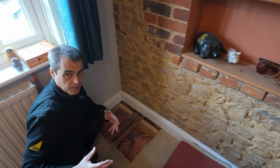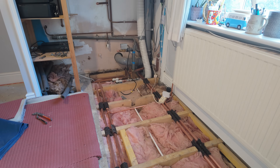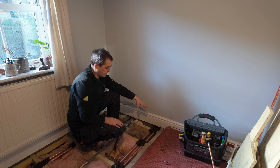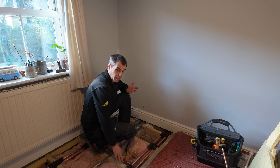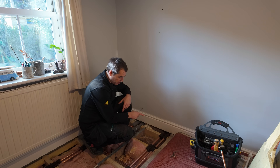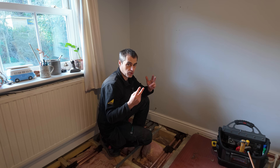Monday we're back on site and it's the coldest week so far — temperatures are dropping below zero — not the best time to remove an existing heating system, but we have no choice. So far we've run pipework: hot, cold, secondary return, flow and return going back to the house, insulated below the ceiling. The flow and return from the plant room in the garage goes 35mm copper all the way here, then reduces to 28mm — 35mm through the joists would require notching too deeply. The 28mm runs to where the airing cupboard was and connects into the two sets of 22mm, splitting the house in two.